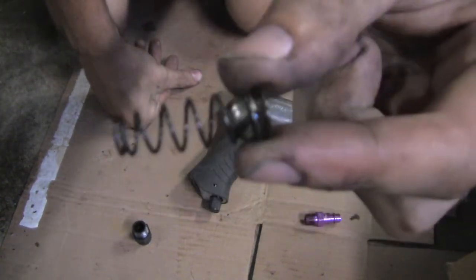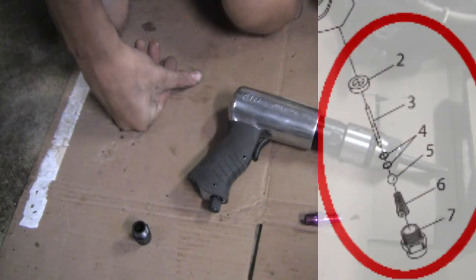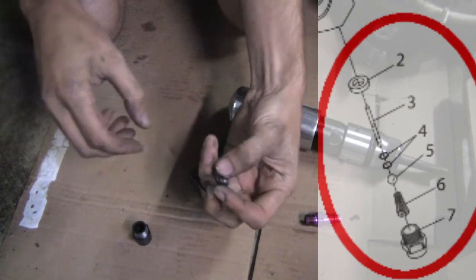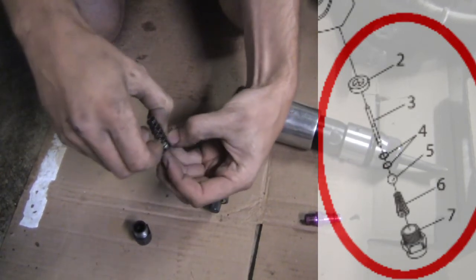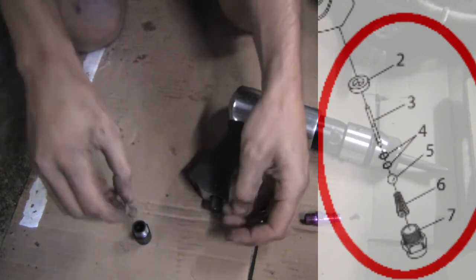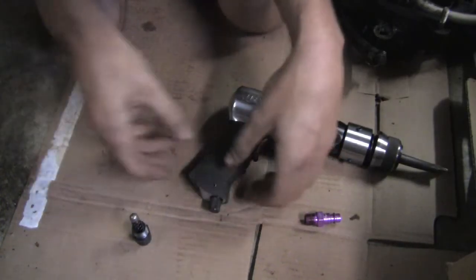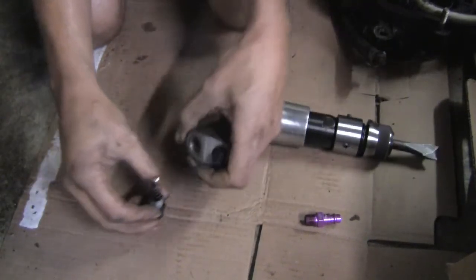See what's happened here? The spring was put in backwards. Clearly on the diagram you can see that the ball is meant to go on top of the small tapered side of the spring, and that spring was installed backwards. Let's just try putting this back in correctly and see what it does.